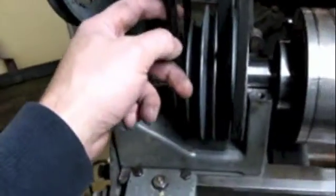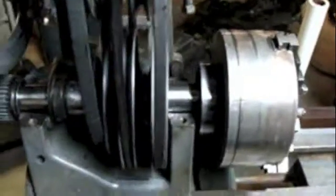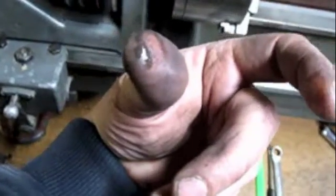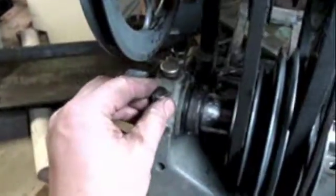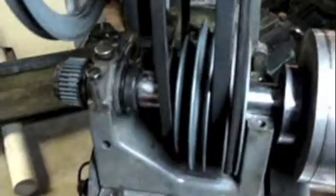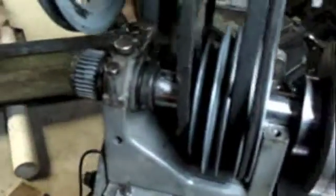This one's just snug. Maybe this one goes here. This big one is certainly too tight over here — can't even get the handle to lock. So the one that's really loose over here must be the one that goes on this drive. The oil has permeated the fabric of the belt so badly — look at the oil just squeezing out of it. I just lightly snugged down this bearing cap so that when I engage this, it won't be pulling the spindle out of the bearing. I haven't oiled this yet, so obviously I'm just playing around with seeing how the drive works. I'll make sure to get oil in these spindles before I even think about putting a motor on there.